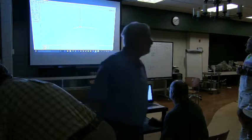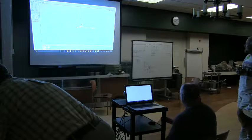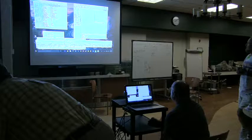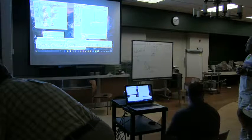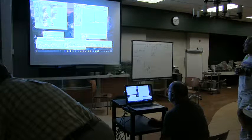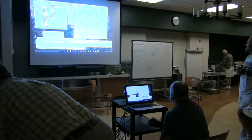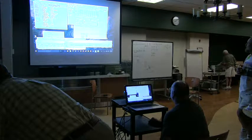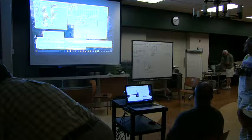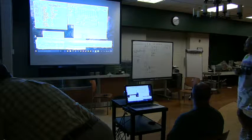What we're looking at here is a 40-meter vertical with no radials under it. But we've got things set in EZNEC here to simulate a perfect ground, so you don't need radials. If we do an SWR sweep with this thing, you'll see that we've got below a 2-to-1 across the whole band. So you don't need a tuner with it. I don't use any tuners. Well, that's what I'm trying to stay away from. Yeah, all my stuff's matched.